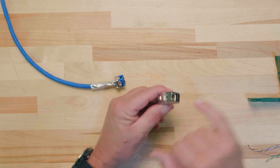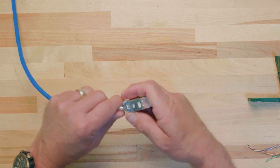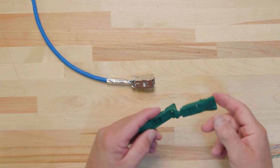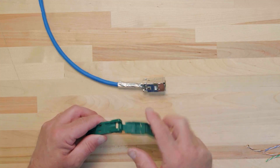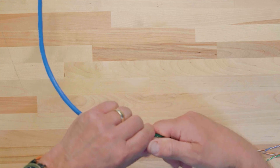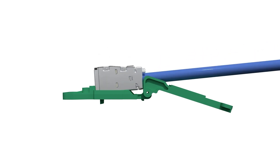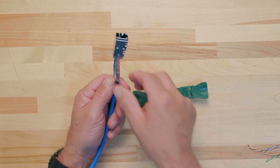Place the jack module on the wire cap with the latch oriented to the strain relief and blue and orange conductor pairs. Hold the tool so that it is open with the tab facing down. Guide the cable between the rounded end of the tool and place the jack module into the slot. Hold the jack module firmly into the tool with one hand. With the other hand, lift the free end to push the wire cap into the jack module until you hear an audible click. The cable end 1 termination is complete and now you can move on to cable end 2.